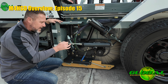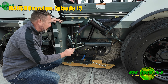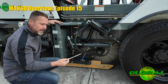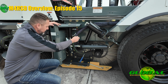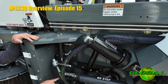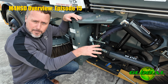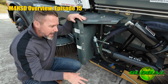That doesn't mean this is a daily adjustment an operator has to make. The way this setup works is simply from this side of the machine — I don't have to do both sides because I have a shaft running the full width of the machine. I can take a similar tool to what I use to change the gutter brooms, insert it into this buckle, and just simply thread that spring up and down the adjustment screw. The amount of tension on that spring is what provides the amount of pull I need on the center broom or pickup broom to control the pattern on the ground.